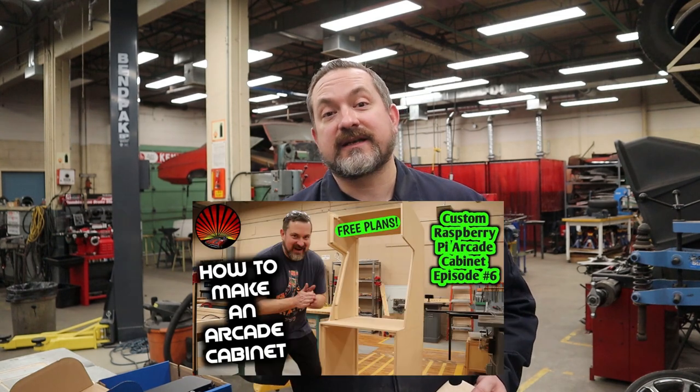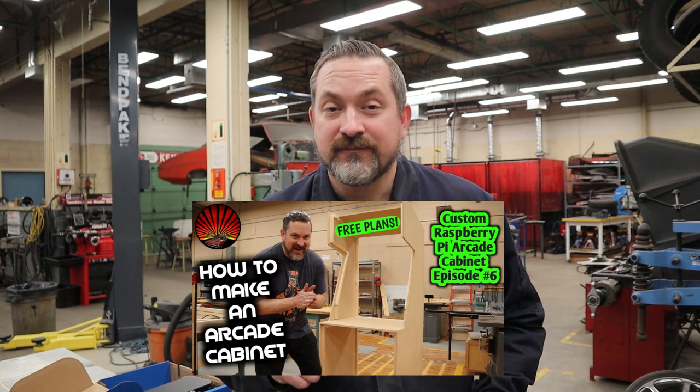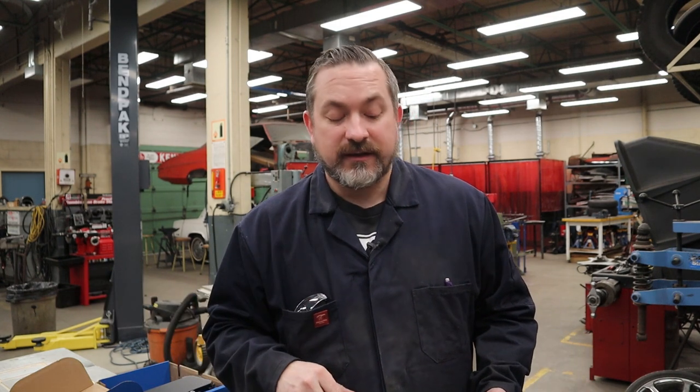Now that we have all of our pieces cut and ready to go, it's time to start thinking about how to put this thing together. Now there's a lot of ways you can put this together, including how I put my Raspberry Pi arcade cabinet together. So if you're not sure about that, I'll put a link above and you can see how I did it that way, using glue up blocks and screws in from the side and then just simply filling them with wood filler after and sanding and get a very solid, straight 90 degree cabinet.